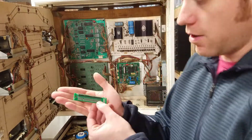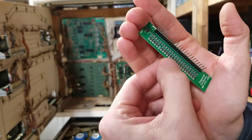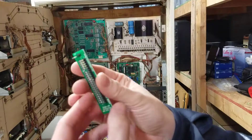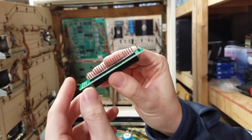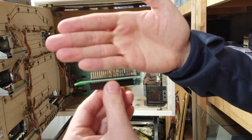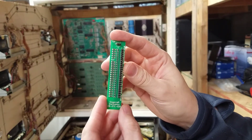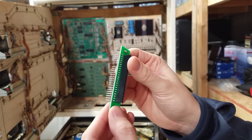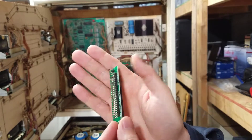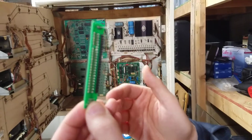These little boards have a built-in resistor — about 750 ohms — and they just sit in-line through the connector. The part goes into the board header, and then your connector comes down and pushes in. I find this to be a great setup. It's a no-soldering solution and it makes a neat and tidy install. So we saw the flickering earlier; let's go ahead and get these boards installed.